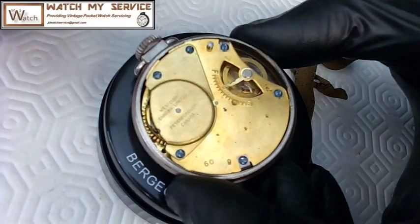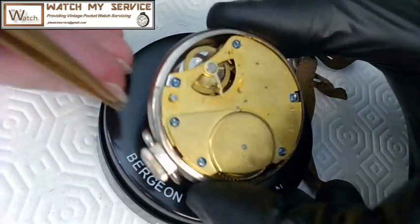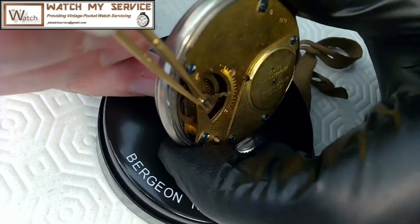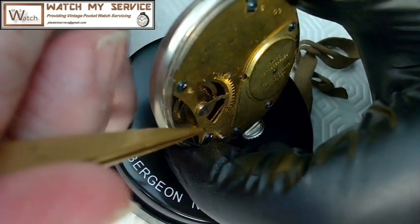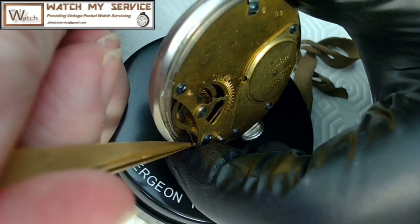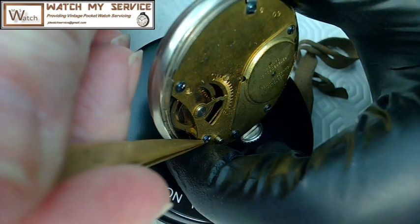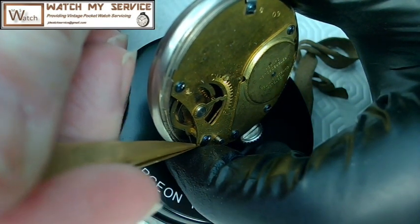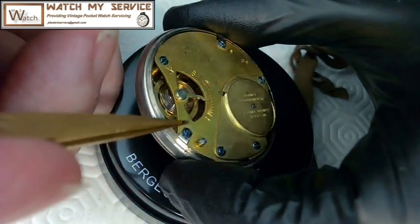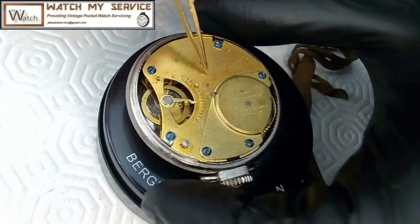Another interesting thing on this watch is that the clips are U-shaped or L-shaped — they go down inward into the watch and turn just a bit and sit there. These retaining clips are kind of pushed into place; you could likely just grab the watch and pull it straight out because of that. There are two of them, one on each side, holding the movement in place.